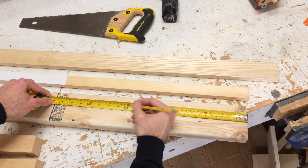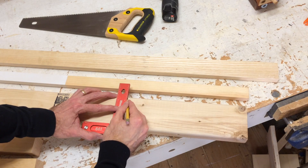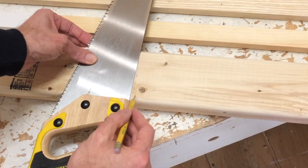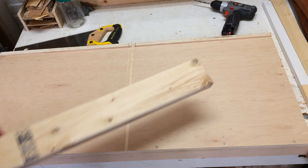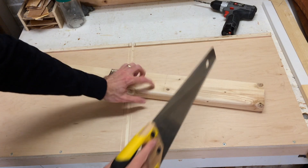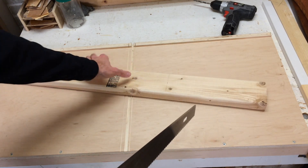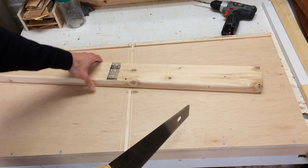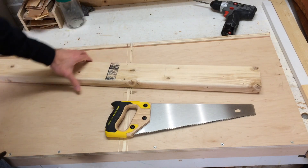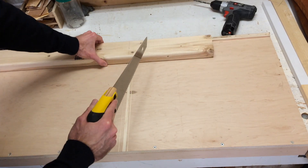First I measure out the wood and cut it with a handsaw. I'm going to measure 12 inches and draw a line across there so I can cut a straight line. I'm using a square — a typical woodworking tool — but if you don't have one, most saws are fairly accurate at 90 degrees. One of the things people get wrong when cutting wood is not clamping it down. Clamp it down with clamps, or have someone hold it. The easiest way is to use a bench hook — just a board with a piece on the front that slides onto the workbench with an edge at the back. Hold the pressure here and the cut is perfectly stable.